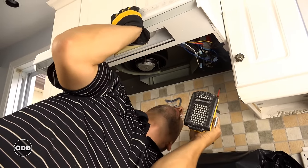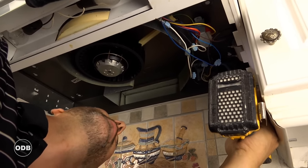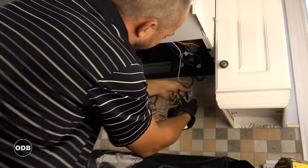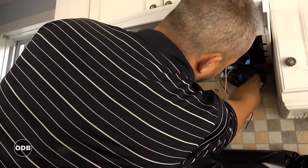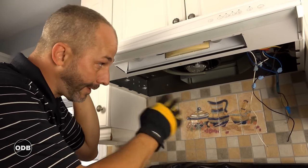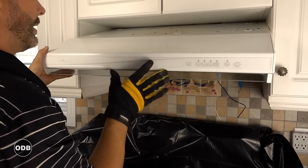What kind of electrics do we have here? We have a blue three-wire coming to the hood fan and the red line is cut — I have no idea where it's coming from, but it's still 14 gauge. Absolutely amazing. And I gotta love the duct tape. So this is live power. Because there are electrical issues here, this is obviously done by the homeowner at some point — not a licensed electrician. They don't even have this wire attached to the hood fan with the grommet. So what we're going to do is remove this hood fan, get it back installed again, and then call in the electrician to take a look at the connection in the breaker panel and connect the hood fan at the same time.